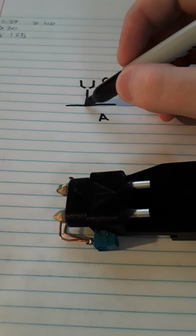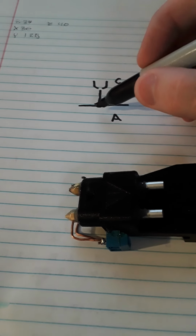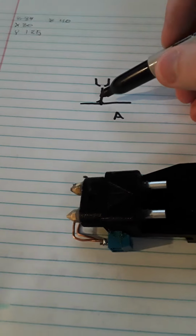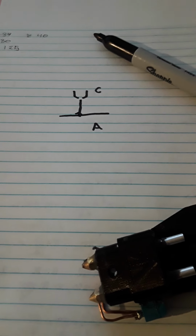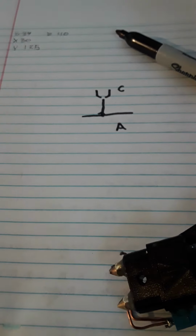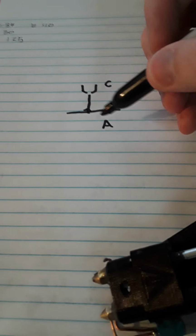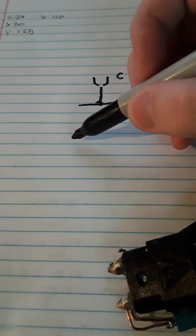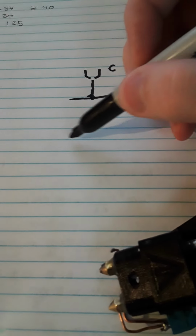And when the water hits it, you get a completed circuit, and it dissolves away some of the aluminum in that area. And what's really interesting about this method is that you can attach, say, this to a 3D printer, spray down saline, and micro machine aluminum just a few microns at a time. So if you wanted to etch images into aluminum or cut small channels into aluminum, or even, if you wanted to make custom PCBs by dissolving away the top copper layer of a PCB, you could do that.